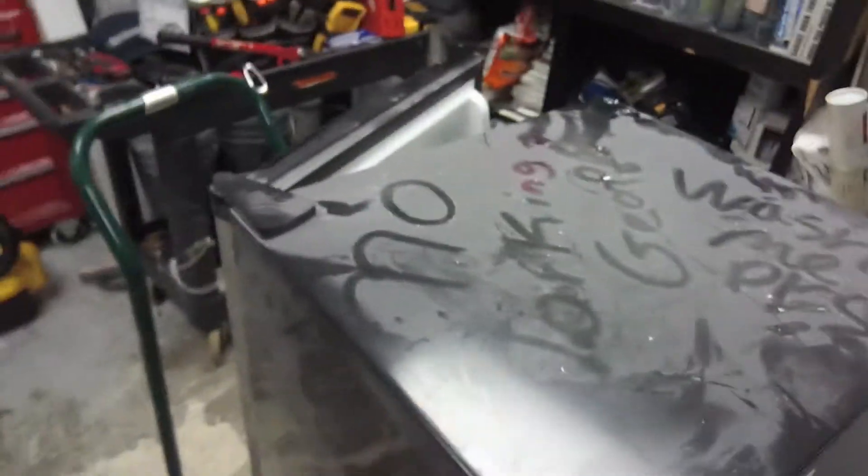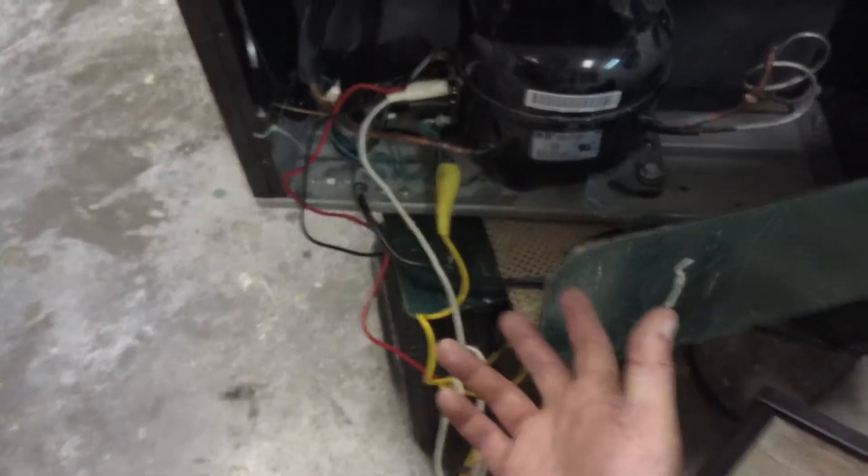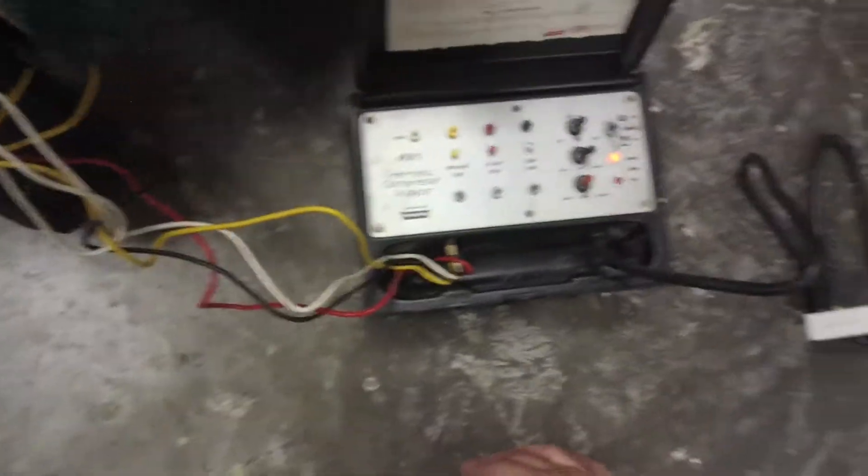It's icing up already. As you know how these little mini fridges work, they're basically a compressor refrigerated unit. This one uses R134a — 1.41 ounces of R134a. This compressor is not straining at all, just purring like a little kitten. When the parts come in we'll replace the start relay and hopefully that'll take care of the problem. It's designed to reverse and do all these tests, even though I can't get it to reverse — maybe there's a problem with this unit since it is a hand-me-down.